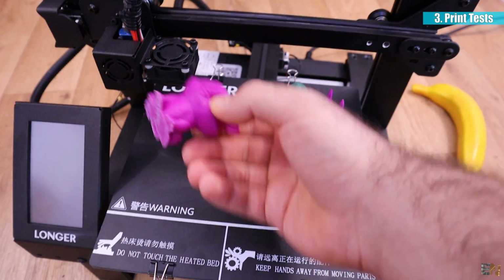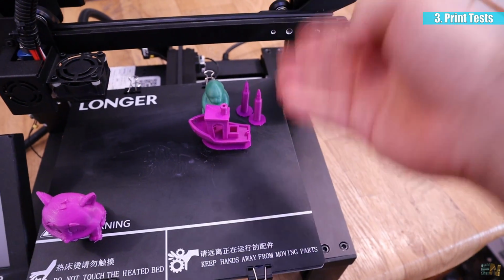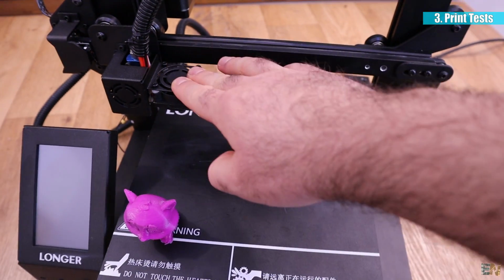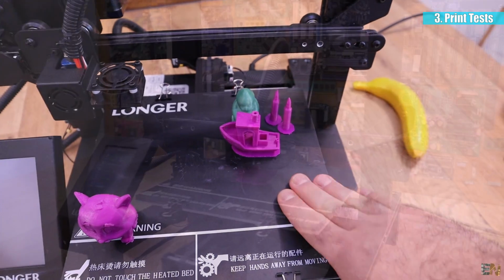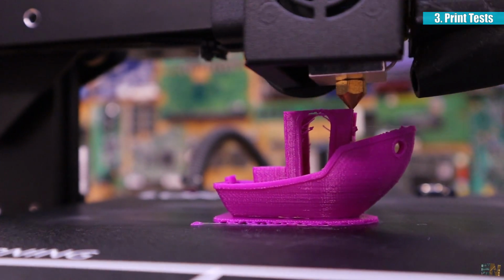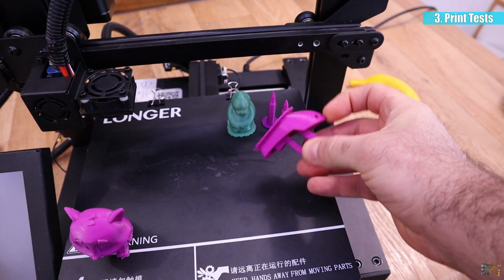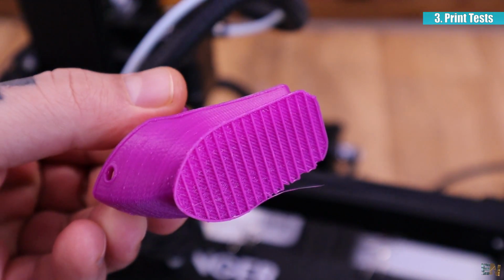Actually guys, it was my mistake with this first print. As you can see, I have some more prints here and I didn't have the same mistake, and that was because the nozzle was pushing against the bed too hard, so the first layer was very low. So all you have to do is to increase the layer height of the first layer and then maybe print with this kind of support here, so you won't have the same problem and you can easily remove the print.